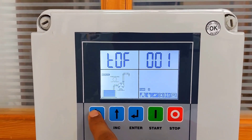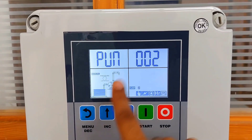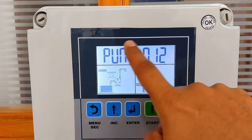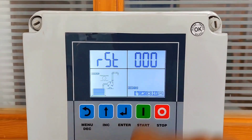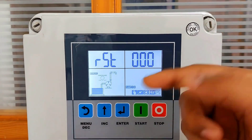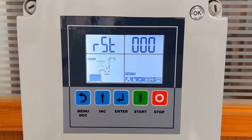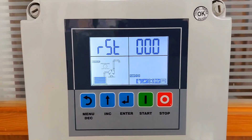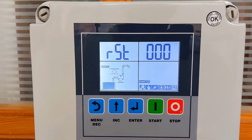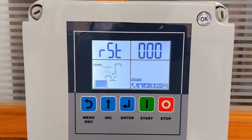This is the pump selection setting — you can choose to run only pump one, only pump two, or both pumps in cascading mode. Here you select your pump configuration. This is the reset function — if your pump trips due to overload, you must reset it before it will run again. For dry run or voltage faults, no reset is needed; reset is only required for pump stall protection and pump overload protection. These are all the settings required at installation — no other settings are needed.